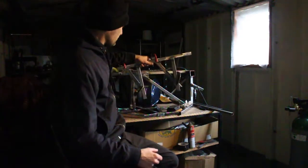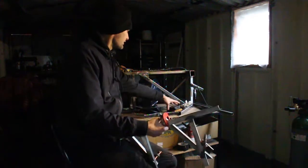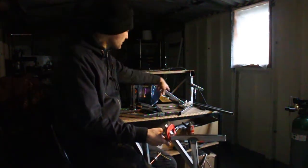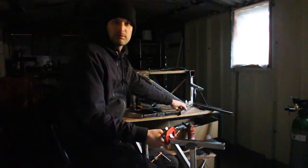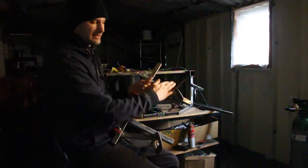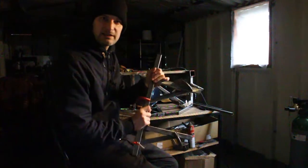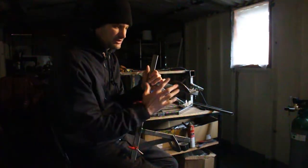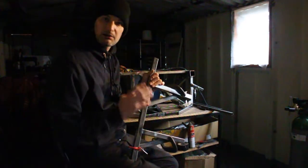You can see here I've started to build the front of the frame and this is how far we've got — we've got the diagonal in at the back there next to the engine. These are yet to be welded in, but this front section is welded in. I'm going to start building this front end first and then graft it on after, because it's going to be easier to manipulate and move around and get into the hard-to-reach places when it's just a small piece.